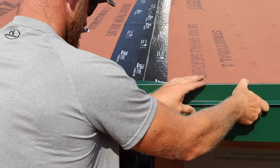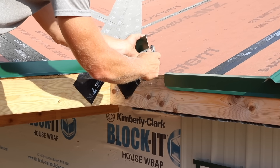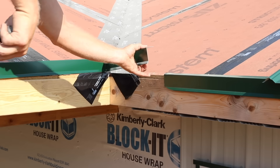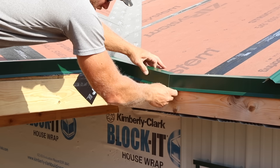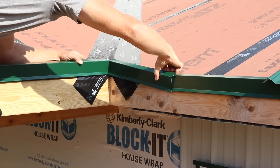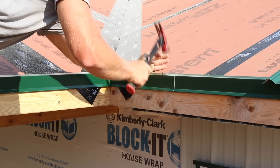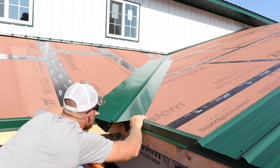As you can see we're prepping for roof steel finally on that back porch area and we've got some valleys to deal with, so we're going to talk and show how the valleys are done. One thing you'll notice is that I always try to not just overlap our eave trims but rather make sure that you notch and slip those notched edges into the hems on your trims.